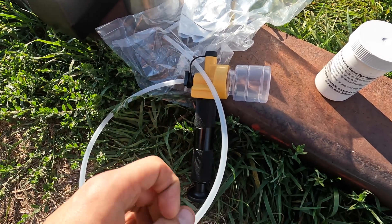I'm going to take out my tube — or the straw, whatever you want to call it — and then unscrew my sample bottle. You just want to make sure to keep everything as clean as possible, otherwise you're going to get a false reading on contaminants. That's all nice and clean. I already opened this up so I'll put my cap back in and get that sealed up nice.